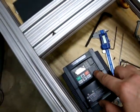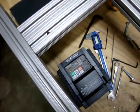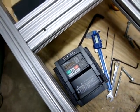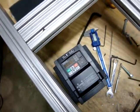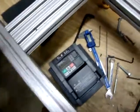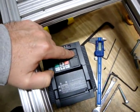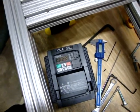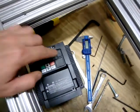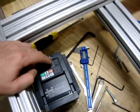It's also got the RS-485 Modbus connector and also USB, which I haven't been able to find out too much information about from the Hitachi manuals. All it basically says is that it uses USB for communication. I don't know if that's a USB to RS-485 converter which is in there — it may be. I might talk to Ed from Drivers Warehouse to see if he can shed some light on it. But if that's the case, I won't have to worry about an RS-485 to RS-232 converter, which will make things simpler and eliminate moving parts.